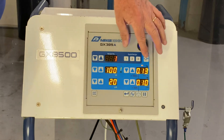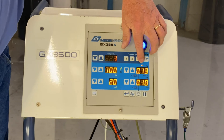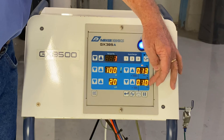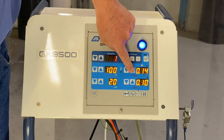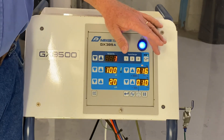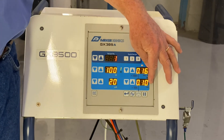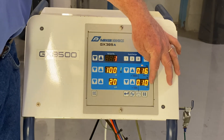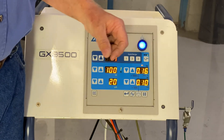Over here we're in MPA mode — independent main air and independent supplemental air mode. The FM control changes up or down and controls your powder flow, meaning how much powder comes out of the gun. Your FS, or supplemental air, is air added downstream of the pump that adds velocity and volume into the hose to prevent settling out and surges.